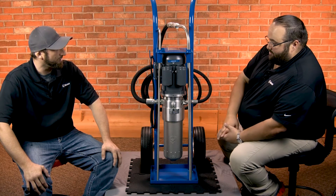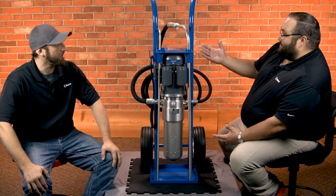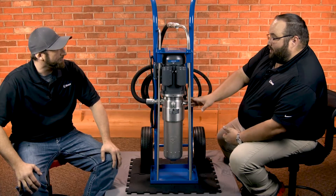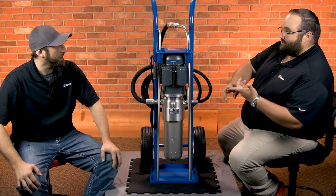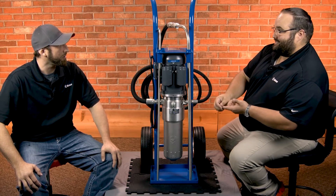Just looking at some of these features, there's a sample port on my side. I know that you've worked with a lot of injection molding machines, and we know that they don't always have sample ports on them. So this is a good option to be able to know exactly what's coming from your equipment before it hits the filter. Since it's upstream of the filter, we're truly understanding the wear going on inside the machine, how the oil is holding up, and it gives us a great place to take a reliable and very consistent sample.